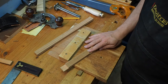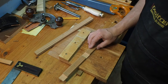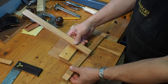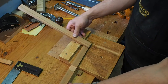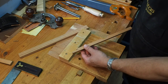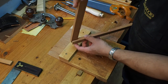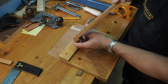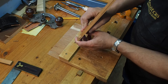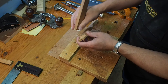What we've got here is a two-panel door where there are three joints that are going to go together, and it's going to go on the front of this jewelry box. It'll have pieces intersecting here, here, and here. What I've cut here is half of a half lap joint. The reason they call it a half lap joint is because it just sort of laps over itself like this. And it'll create a big glue surface on both pieces.